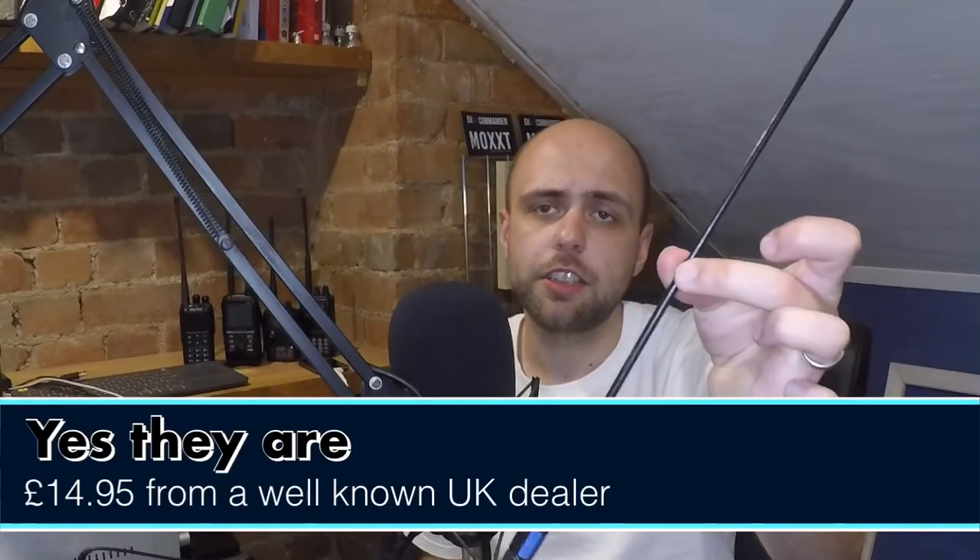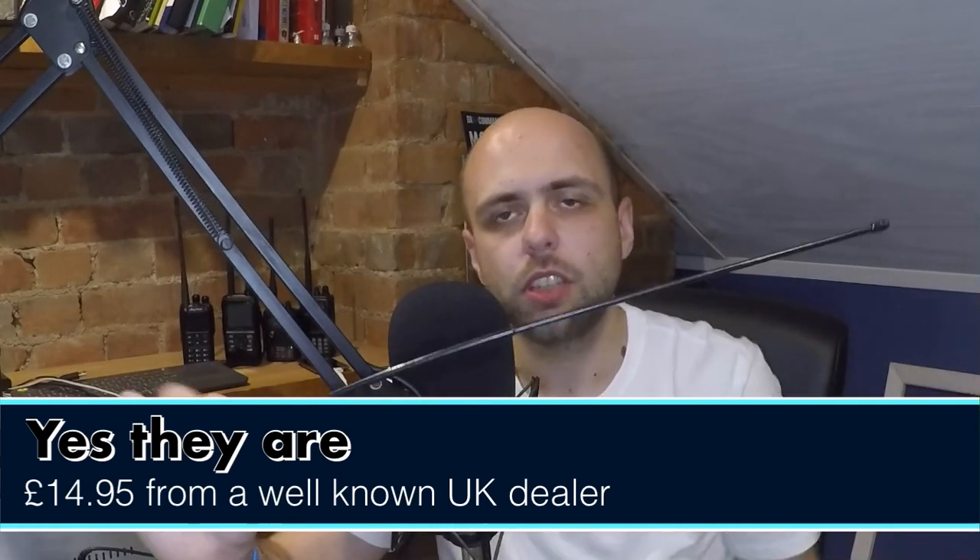Finally, a Watson antenna — the WH270. I haven't done research on whether they're still making this. I use it with the IC705 and it's the only antenna I've found that presents a low SWR without a counterpoise wire on 70 centimetres — a little bit higher SWR on two metres. I don't recommend it for most handhelds because it's BNC rather than SMA, but if you have a BNC antenna connector it might be a good option. That's another antenna I happen to own and use periodically.